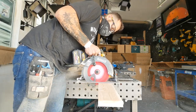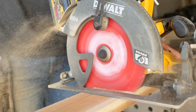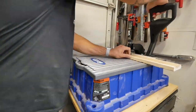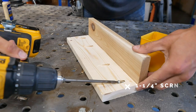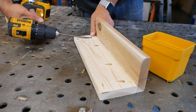The general construction consists of corners that the rest of the panels would attach to. Starting with the base, I cut a bunch of lumber into 16-inch long pieces and pocket-holed one of the boards, attaching it with glue and pocket hole screws to the other board, creating these corner L-brackets. Once I created my four 16-inch long corner pieces, I was ready to get started on the cooler part and attaching the panels to it.